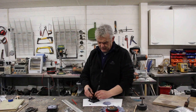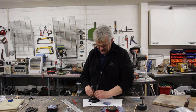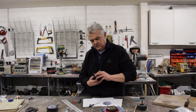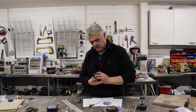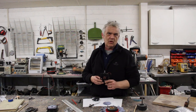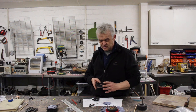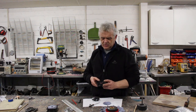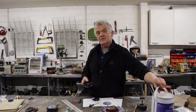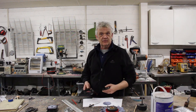There isn't much need to worry about the internals, because what's in here is just some magnet wire coated in an insulating layer with a couple of wires soldered to it — we've removed the circuit board, so there are no electronics in there. You can protect this from water dead simply: just dip it in some varnish, or dip it in a rubber coating material like Plasti-dip, leave it to dry, it'll shrink down and it's waterproof. That's all you have to do.